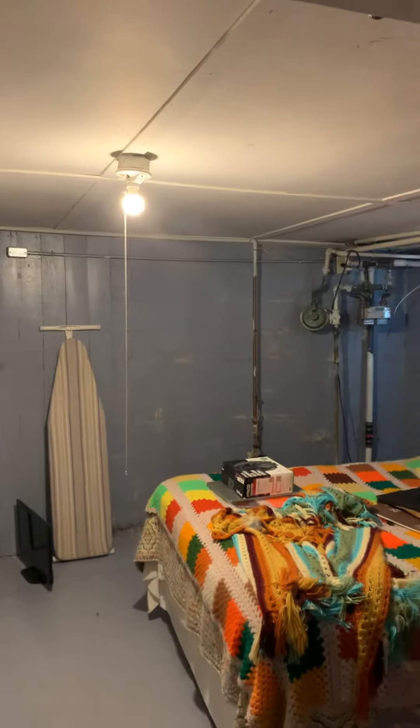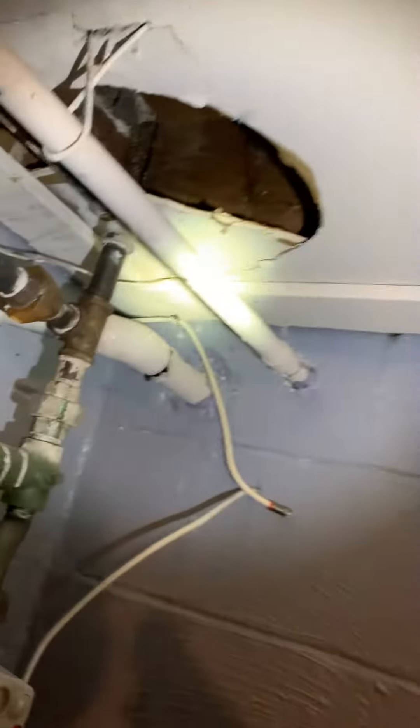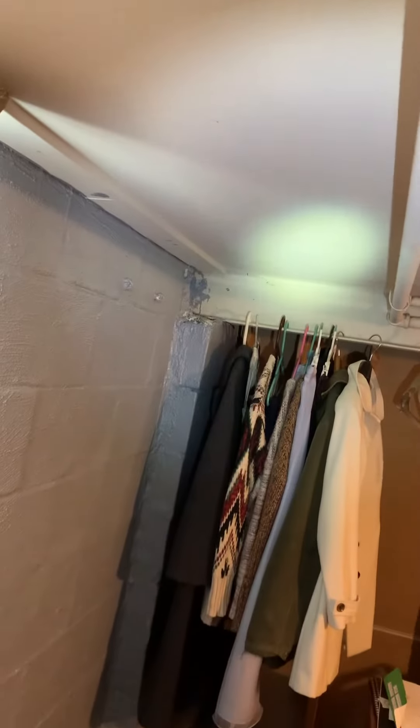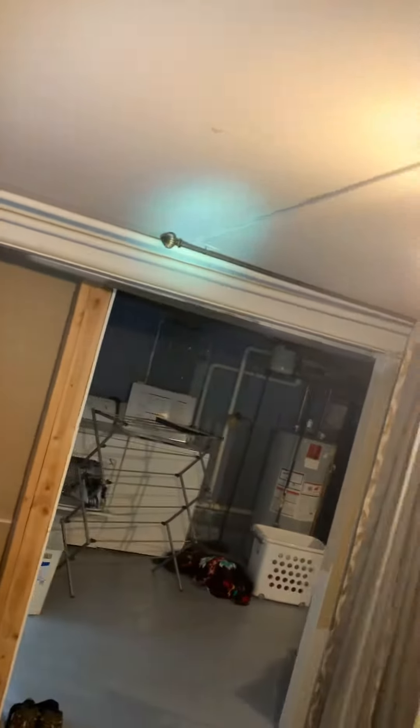That's all of our ductwork. For the gas line, we've got some gas lines hanging really low and we want to clean all this up. Here's our meter — this ceiling will be down, but we're looking at bringing this gas piping up into the joist run as tight as we can, then come down from the joist run as tight as we can to this I-beam, jump back over the I-beam and ductwork, get into one of these soffits, run through the floor joists, then come back down to catch the water heater and come over to catch the furnace.